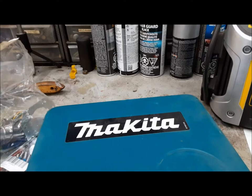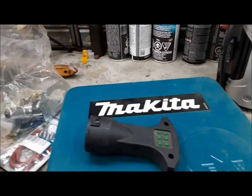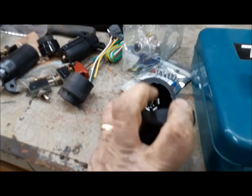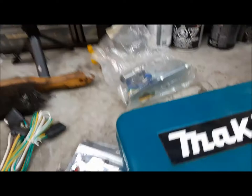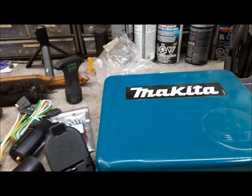If you're having a problem and you don't think the problem is the truck — this thing will show you that the truck is working — we can use this to test the trailer. I've got this connector here; it's got a 7 and a 4, that's pretty handy. We're gonna use this old-fashioned round 4-pin and make a little harness that we can attach to this thing. This will be our jumper cable because I do want to be able to plug this thing into the truck also — why not.